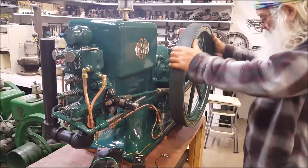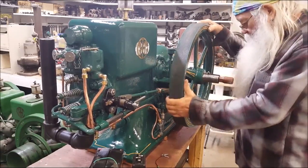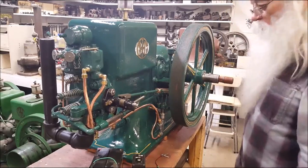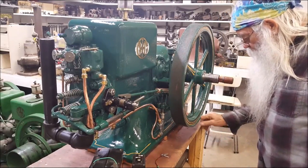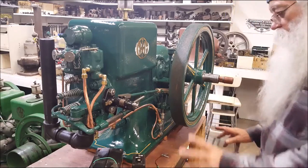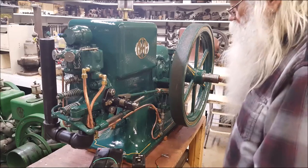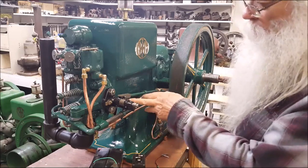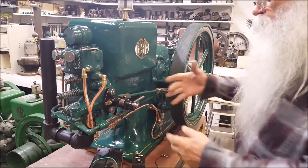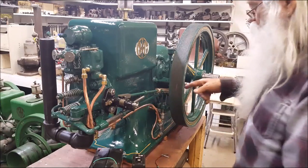It's getting ready to come up on ignition, up on compression. When it comes around on compression — that's where the engine fired. Right down here is where the little notch is, exactly right there. If you look on the block in there, it's perfectly timed. For this to snap when in this position, you adjust that. There are shims behind the igniter you can adjust — the thread goes in or out to make it trip sooner or later. It works on a cam in there.